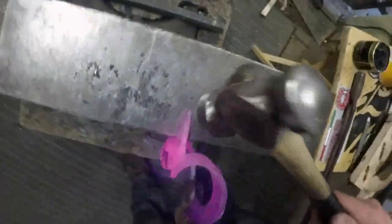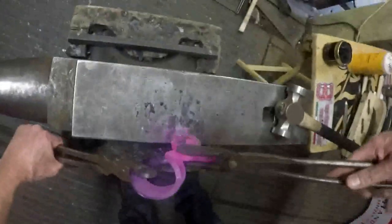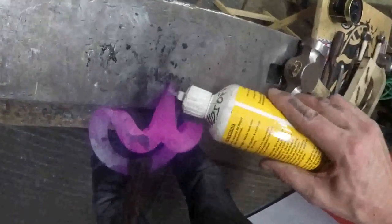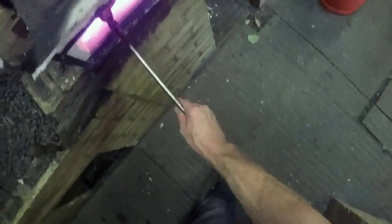It's got a little crack there, so we'll just have another cheeky little heat on that. But I'll flux it up, I'll forge it that way, then I'll forge it down there just to forge that little scarf out there, and then I'll get the half round tongs that I've got ready. I'll put them on there and I'll bend it back flat, level it all out, and then we'll start marking the fuller in. So I'll flux that up. It's welded together, but just for aesthetics, it's nice. We should not have any cracks or any scarves visible.